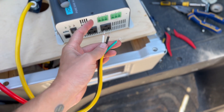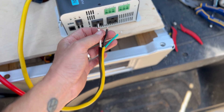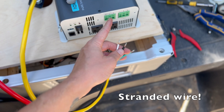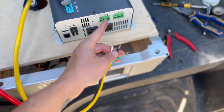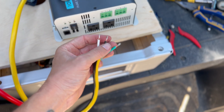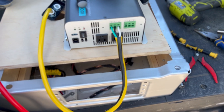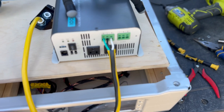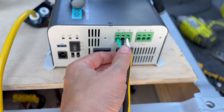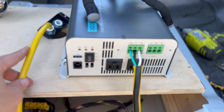These wires really didn't want to insert into the connection here. They're just normal braided wires instead of solid core, which I think these connectors are designed for — like Romex solid core wire. So I threw some solder on them and hoping that they insert now. Much better — went in and they're nice and snug now. I'll throw a little tape on them and then put the cover on.